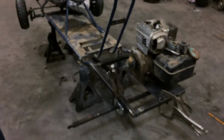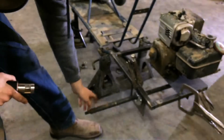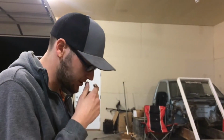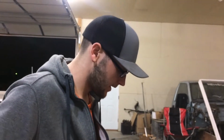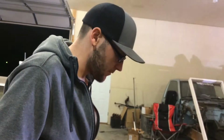That's what I was getting ready to say, if I have enough room, because I'm going to take a couple inches off this axle. I'm going to cut this off flush and then drill and tap it to accept just a 1-inch keyed hub. I've got a machine shop that's going to key the axle for me for free. So I could put the brake disc on the outside. I think that's it. I just need to decide where I want to push this axle.